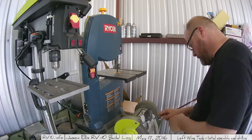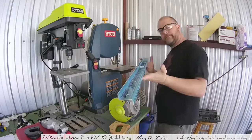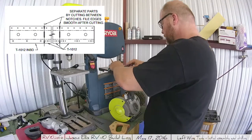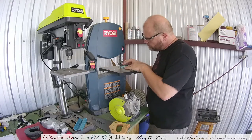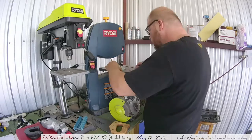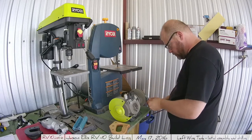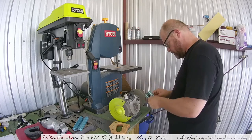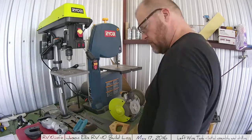It took a while, so this is going pretty fast, but it's pretty simple. Next, I'm working on the Tank Attach Z-Trim. This is sort of the same thing — you've got to cut several of them from one single piece of metal that you then clean up. This will go across the back of the tank and is the primary way the tank actually attaches.